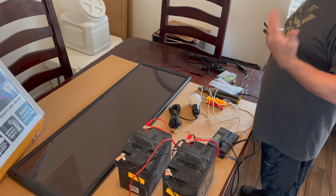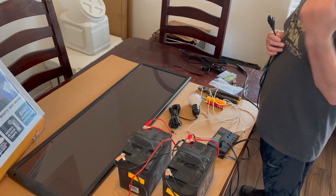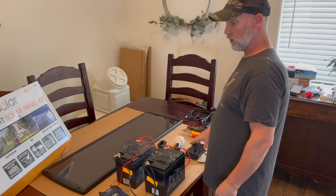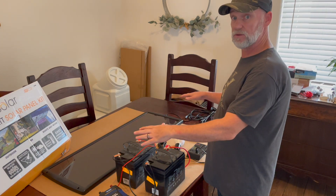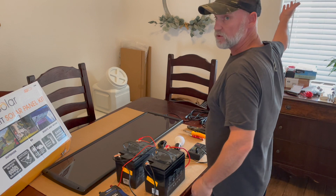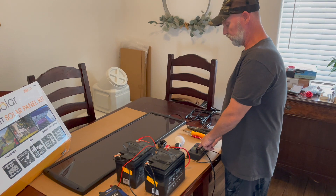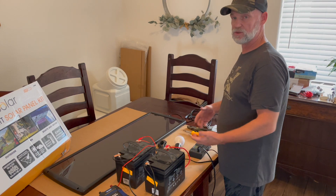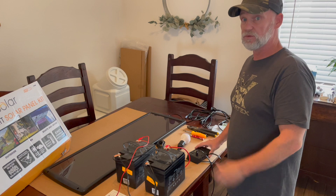Once again, this is going to our shed — we just need some additional lights and maybe a couple of outlets to charge our cell phones, run a fan, a light. It'll do all that. You want to wire everything to the charge controller, and the last thing you do is hook up the solar panels. Some people cover the solar panels with a blackout blanket to get minimal charge. Right now we have some sunlight coming in, so you can see the blue light showing some charge — we've got 12.4 volts. You have to program in what kind of battery you're using so that it knows how to charge and do its readings. For a couple hundred dollars, you've got yourself some power.